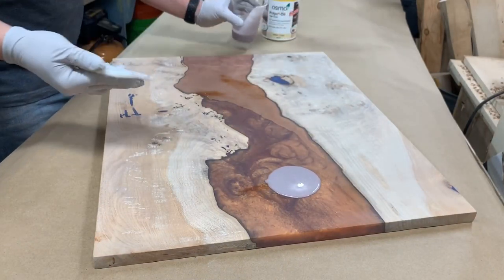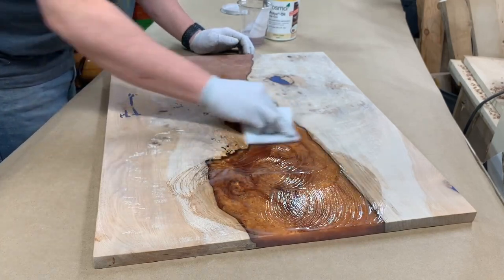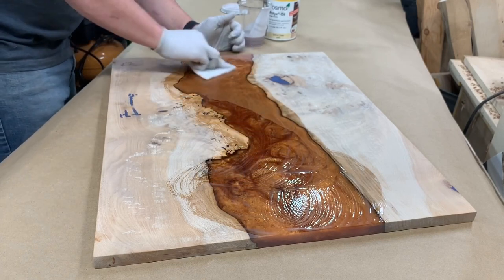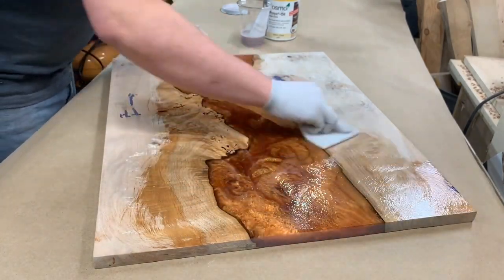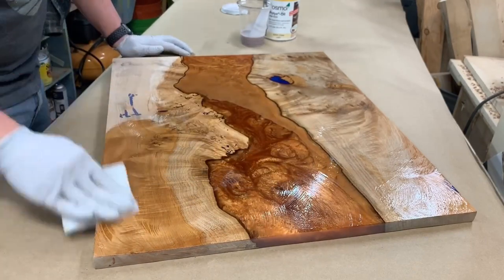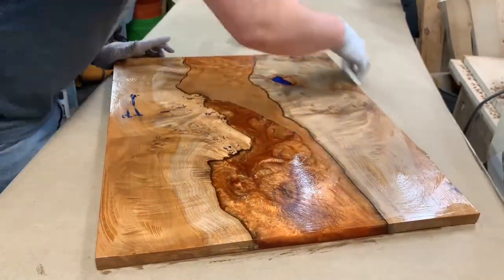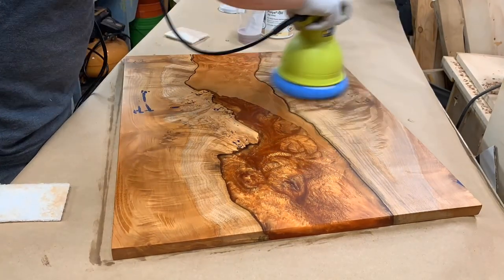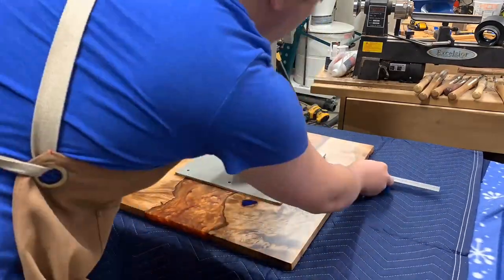Then I did Osmo. I had been wanting to try this forever — it's what a lot of people use for river tables, and man, this stuff is the real deal. Not sponsored, but believe the hype; this stuff is incredible. I went with a scotch bright light scouring pad — non-abrasive — just to buff it in and clean up the surface. There are plenty of ways to apply it: a blue shop cloth, a card spreader, a credit card. The most important part is to come back afterwards with another scotch bright pad or shop towel and dry it off — you don't want to leave any on the surface. Buff it in with a Ryobi palm buffer, about $30 at Home Depot. After one coat the finish was incredible; I ended up doing three coats. Definitely worth it — I love this stuff.